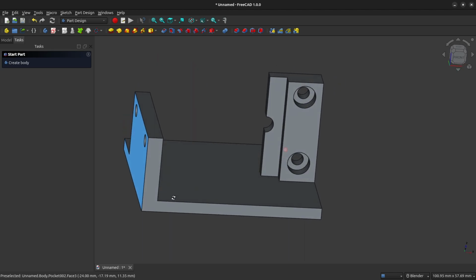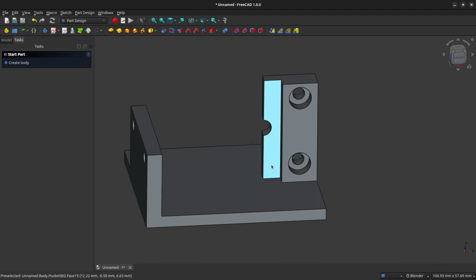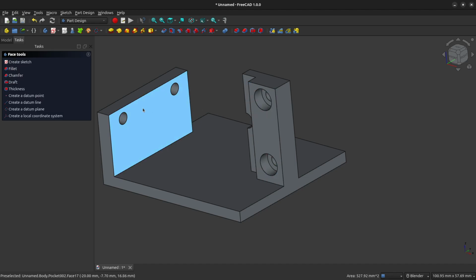And our speed sensor has some pins on the back of the circuit board that protrude out past the edge of the circuit board. These are sort of the mounds created by the solder as they were used for soldering the main infrared sensor onto the board. So we need to clear away some of the plastic on the inside of this pedestal here, or this bracket, to make room for the pins that are protruding from the back of the circuit board.